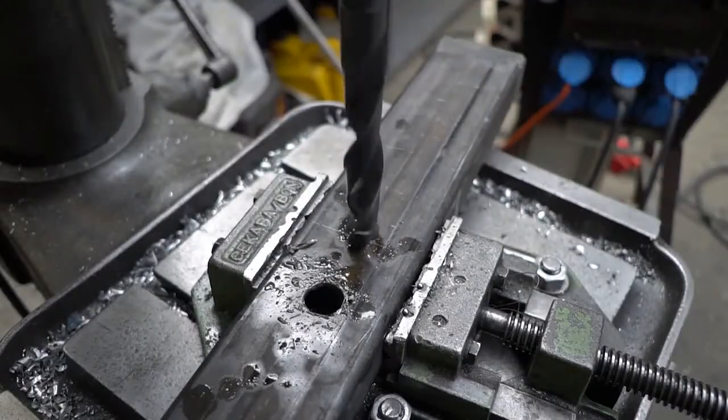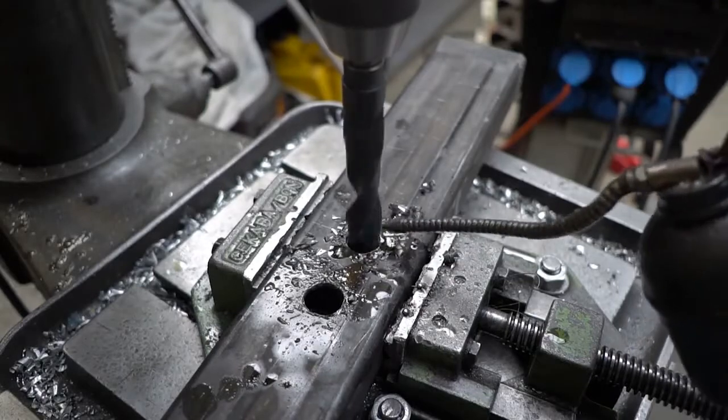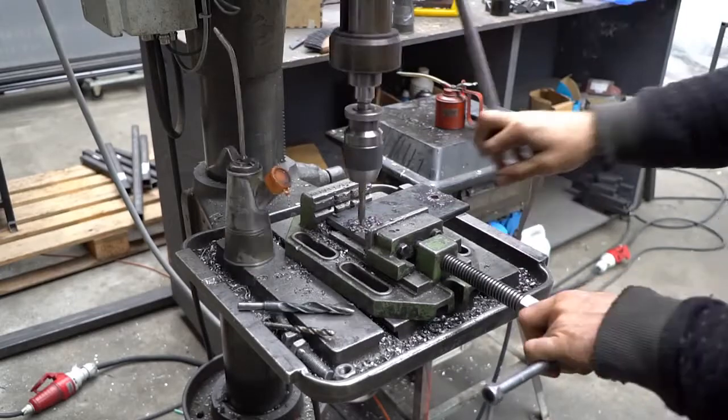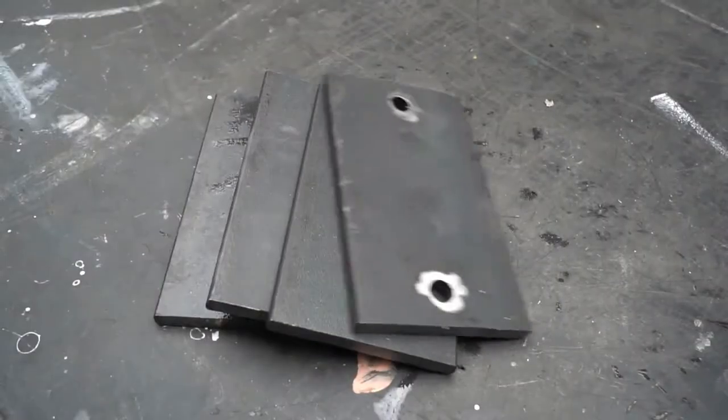Before you weld, you can drill a few of the holes you'll need to make for the motors and the cable management holes. Wait to drill the more critical holes until after you weld to ensure proper alignment.